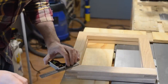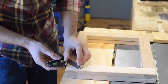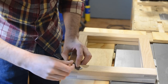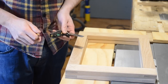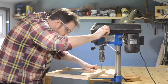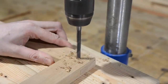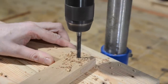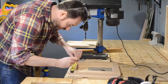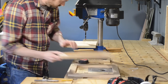When the glue dried on the legs, I could come back and reinforce the corners — not because the joints need reinforcing, I'm pretty sure I could hang off these, they're incredibly strong, but just to add a little bit of copper detail to them. So I'm marking out the centre of each joint in all four corners, and then I'm going to drill through with an 8mm bit.